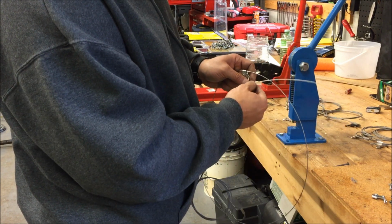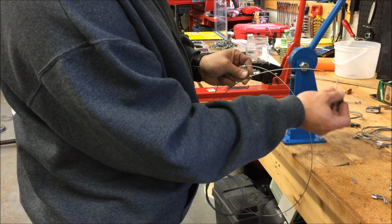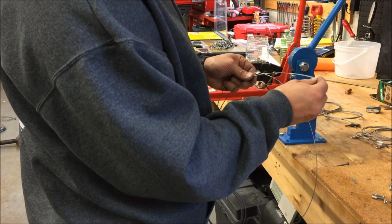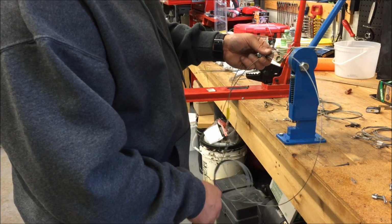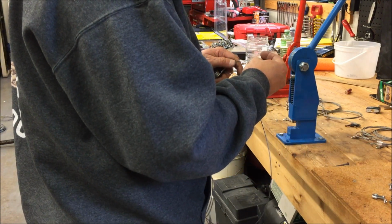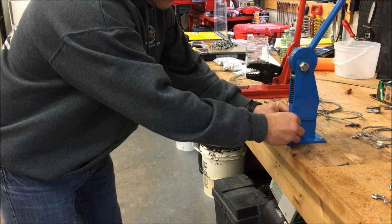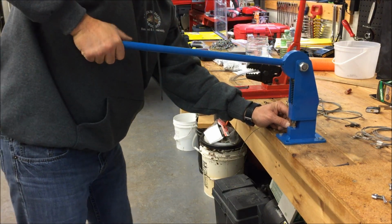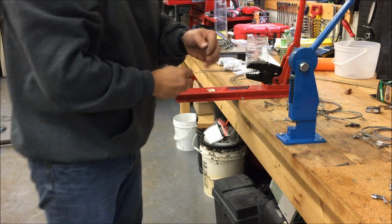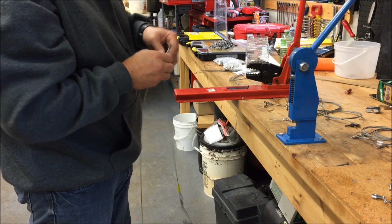And the purpose of this washer is to keep this loop here, this S-hook, from going through the spring. Just acts as a buffer between the two. They can twist in there if you don't have those, and then actually open them up that way. So now I got, in this sequence here, I put my two single ferrules. Now I can make my loop.